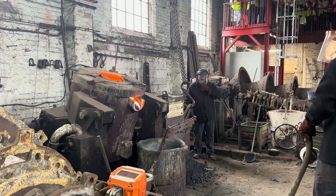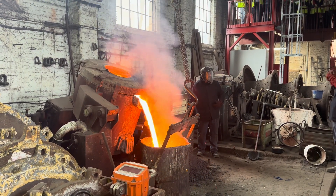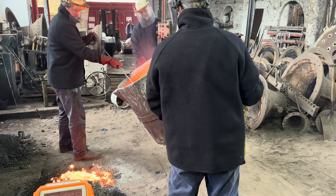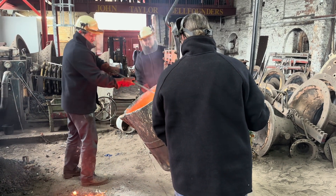You watch the metal level slowly drop as it melts, and then when it gets to a certain point, we add more metal to it, so there's a constant supply. We'll put in what we call the pouring ladle, tip the metal into the ladle, and then that gets lifted with the crane. We do a load of prep work to it — we'll clean off any slag, any impurities basically, that are on the top. We scrape them off so it's just pure, clean bell metal.